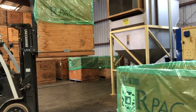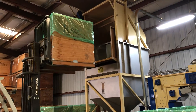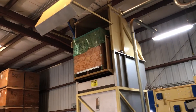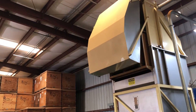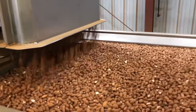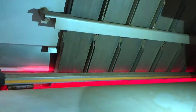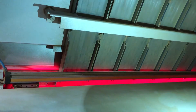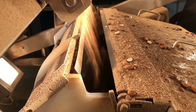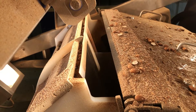After the kernels are finished with the hulling and shelling portion, they are stored in a warehouse until they are brought into the processing plant. During this portion, the bins of almonds pass through three different optical sorters. The first two optical sorters are similar, and you can see every time they discard one of the kernels for not meeting the quality specifications via the green lights that keep flashing. For the third optical sorter, the quality kernels continue on while the kernels that do not meet customer specifications are blown to the back and go into making products such as almond flour and almond milk.